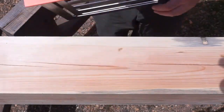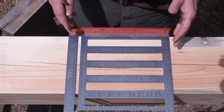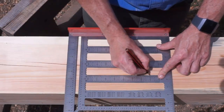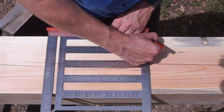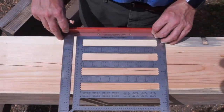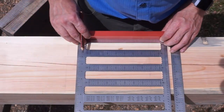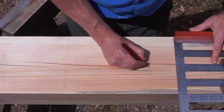I'm going to lay out a basic mortise and tenon for you. It's all theoretical — it's going to be for a ten-inch timber, so it'll be nine and a half inches. We already got two and a half inches, so all we've got to do is go to seven — that'll give us nine and a half. Draw that line. Now our tenon — our mortise — lays in the middle of this, and it's three inches off the reference edge. Flip it over, go to three inches, and drag it up. It's two inches — one, two. And so there is our mortise.